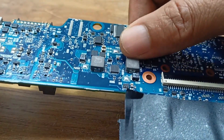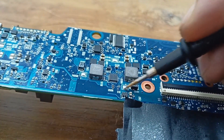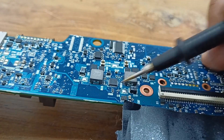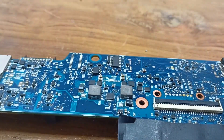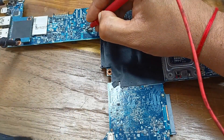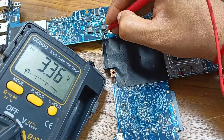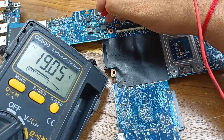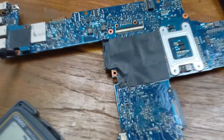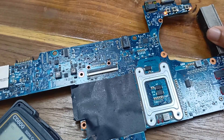Okay, our circuit is clean and dry, very perfectly — there is no dust on the circuit. You can see: this one is 3.3 volt, this one is 5 volt, this one is 19 volt, and this must be working for the 1.25 voltage. All voltages we are getting are okay. But this voltage was not present before. Okay, let's plug in the charger. This point is the 5 volt — you can see here, 5 volt is present. And this one is 3.3 volt — 3.3 volt is also present now. That voltage was missing before. That means our circuit is okay right now. This is the 19 voltage and this one is the 1.25 voltage — this voltage is also okay.